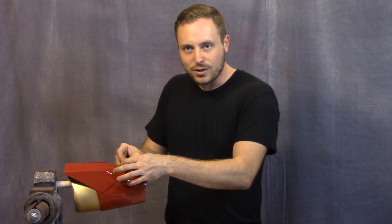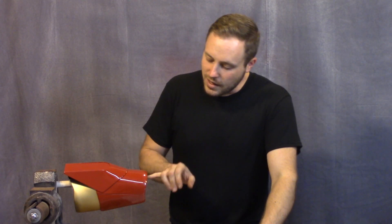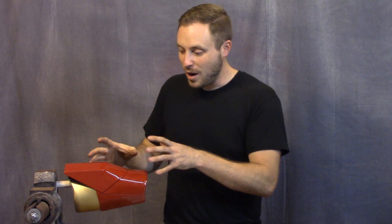After removing those magnets I resoldered connections, rerouted wires, and tried to make them shorter, but still had almost the same problem. Then I realized that with the glove inside, something might accidentally hold the limit switch on, and bumping the rocket launch button could fire it when you didn't want it to. I didn't want melted Kydex all over my arm, so I added a master kill switch to the rocket launch setup before moving back to the main closure problem.